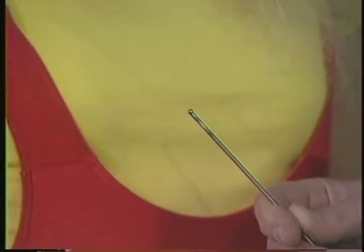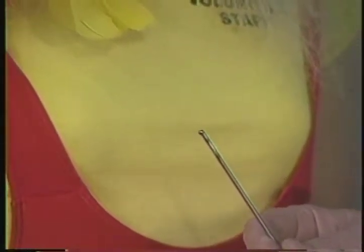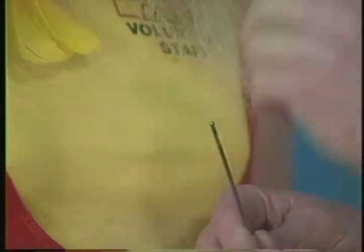Now this is pure tungsten, not 2%. We use this for welding aluminum, and that's what always happens to the end of the pure tungsten. In part because of the way tungsten behaves, and in part because we're dealing with an alternating current, where the current is going out and back in, out and back, instead of all in one continuous direction. So it tends to hammer the nose of this thing a little bit as it goes back and forth, the same as it breaks up the oxide.